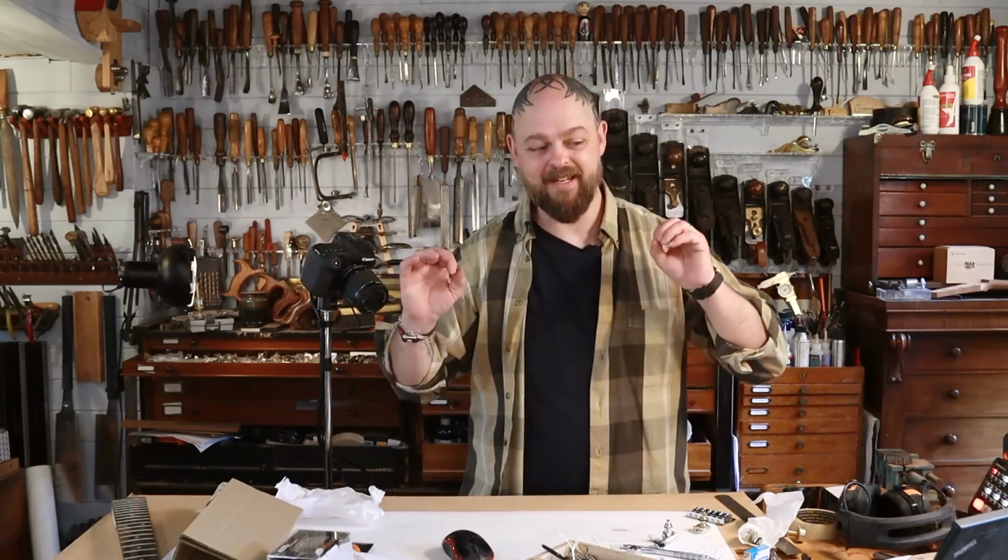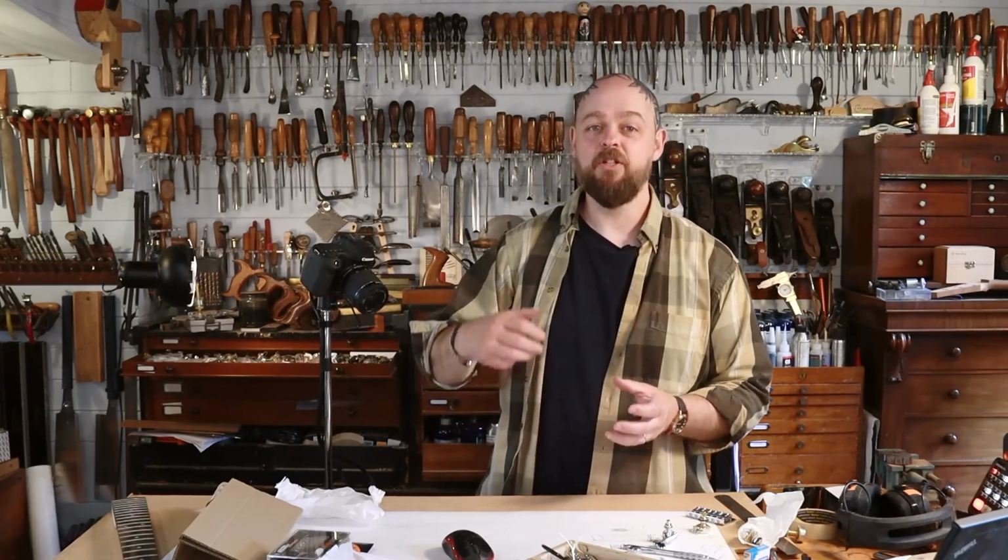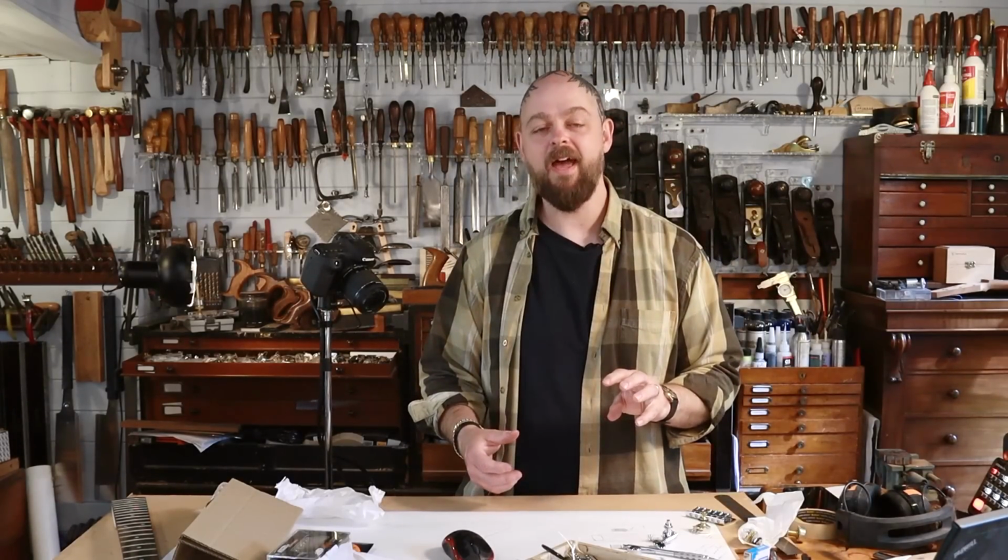I would absolutely love to chrome plate the body of this guitar. Chrome plating wood is an absolute nightmare. You essentially have to finish it to perfection. You have to have a substrate that's absolutely flat and stunning and spot on. So you go through everything that you would normally do with undercoat, and then you buff it down, and then high gloss that you build up, and then you buff that to final finish. That final high gloss that is perfectly flat has to be something like our shielding paint.